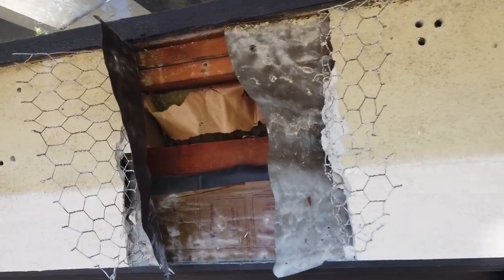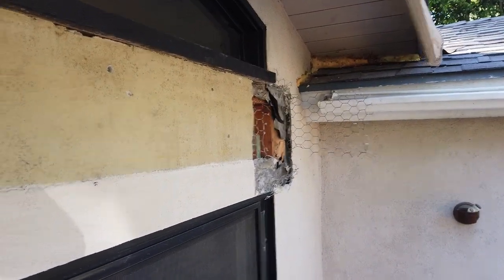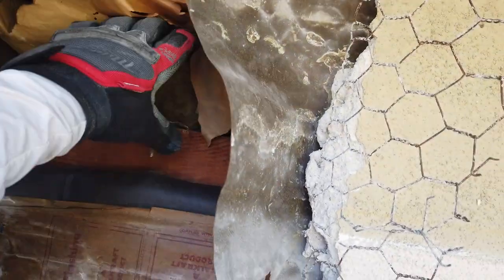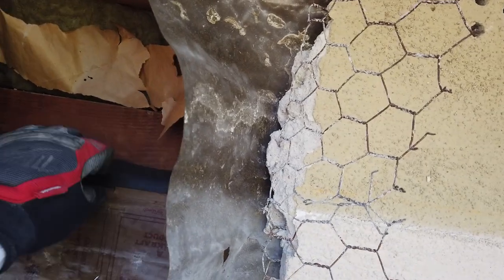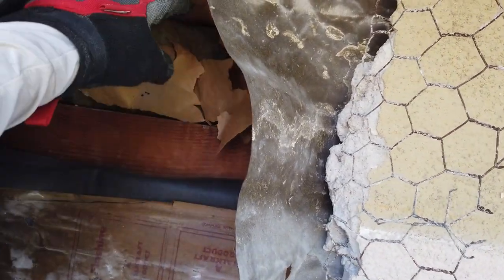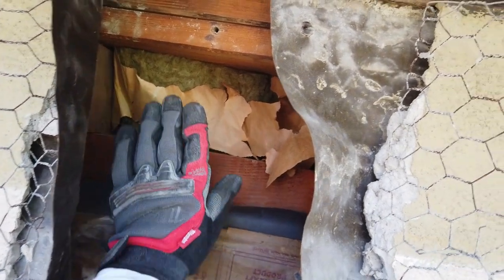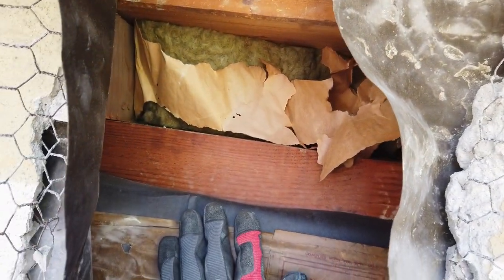I finished opening the wall up for the hangers. I can finally see how this wall was built and why it was so challenging for the ledger board. There is a 4x header in the back with a 2x6 attached to the bottom. So for the two center beams, my plan is to attach a 2x10 to the header and top plate and then screw the hangers into that 2x10.